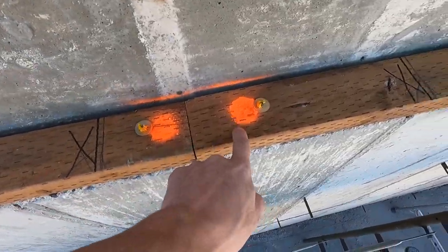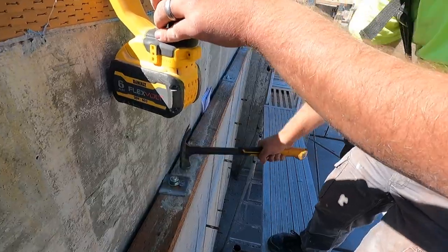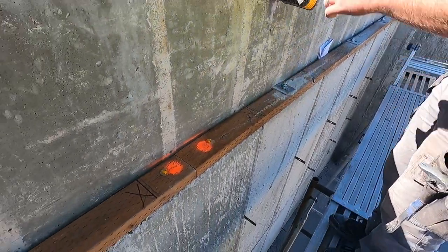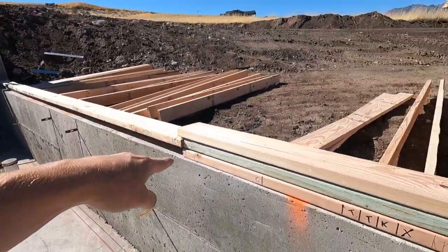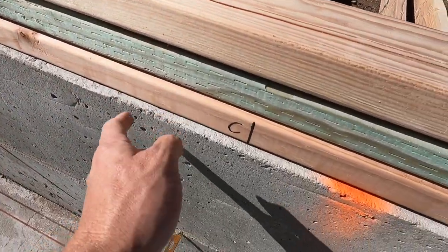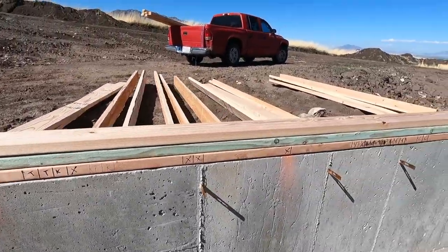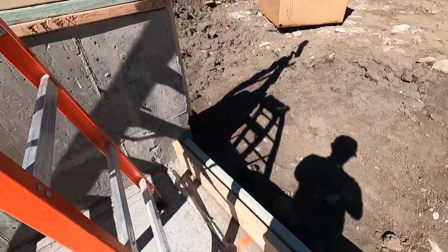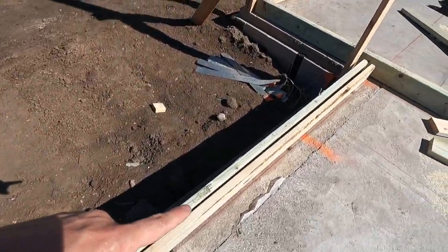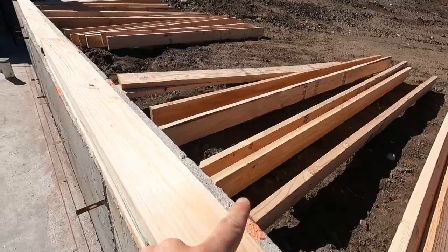He's gone and marked with paint where he's got to put the new anchors. That plate's not coming off there. What is super cool is the way these guys are laying everything out — they'll just stretch a bottom plate and a top plate, the bottom plate being the treated piece of lumber and the top plate being just a regular piece of pine. As they mark one, they strike both at the same time, so everything can be cut and built as they go. One guy is laying out and marking everything following the prints, and the next guy is laying out studs relative to what it's saying.